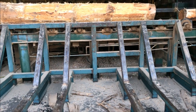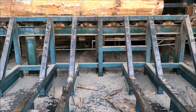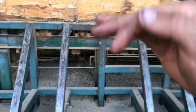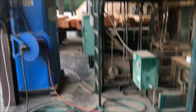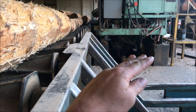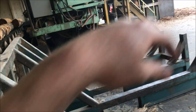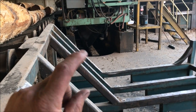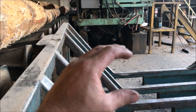But here's my issue. I'll tell you what you could do. See, because the sprockets need to come out of the way. See, this one's got kickers on the back, but this here wouldn't. To eliminate moving parts, you wouldn't have kickers. So if you come out and got your chain conveyor out this far where they can dump off, so they can make multiple layers of mess. But here's my problem. When you come in with the loader, how do you keep from destroying your sprockets if they stick out where they need to?